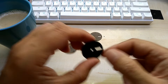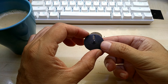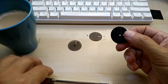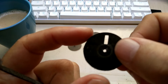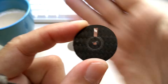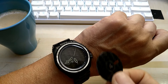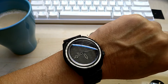After using this as a template I did drill three holes — two millimeter holes — because the cutout window according to Seiko is two by seven millimeters. That's where I'm getting now, using a tiny metal file and eyeballing it to get it as close to a rectangle as possible. After I'm finished that, I will put it into the watch and then we can see the weekday and the date — and I cannot wait for it. And this is it.